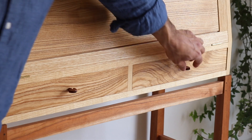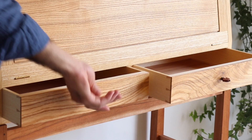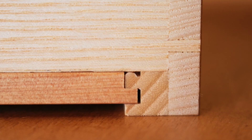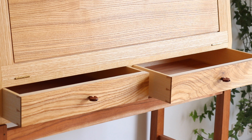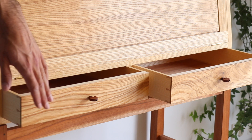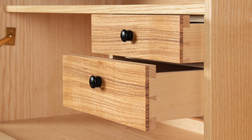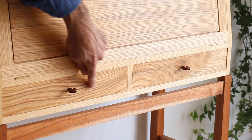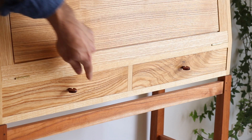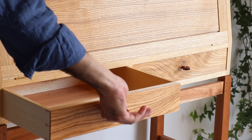The drawers are made in the English style, as you can see, with very thin drawer sides and flush drawer slips. First is the veneering of the fronts, which is made with four millimeter thick veneers, and there is grain continuity as you can see here, and there is also grain continuity in the drawer bottoms.